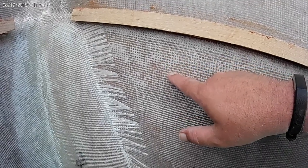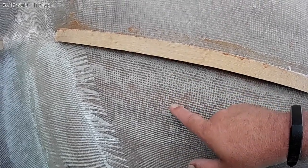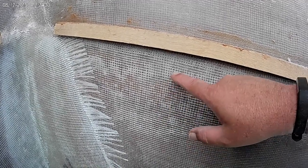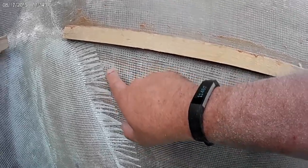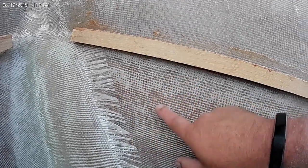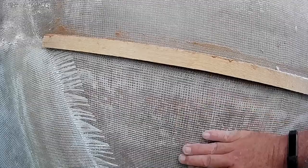So being a stitched fabric, you can see here there are little binder twines. And this is what holds the fiberglass together. So as I'm sanding to prep for a coating or a paint or whatever, I'm sanding off those little binder strings that stand proud of the fiberglass. So unless I dig really deep like there, I'm not into the reinforcements at all. But I really only have to get about 50% sanded off to get a good mechanical connection for the paint. So that's what I'm doing.